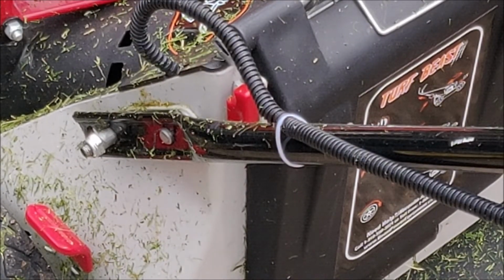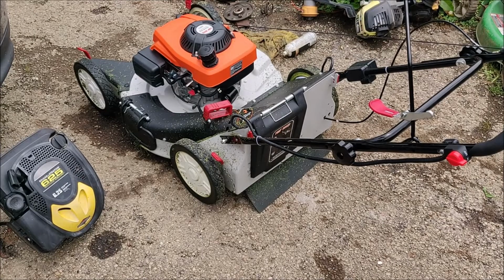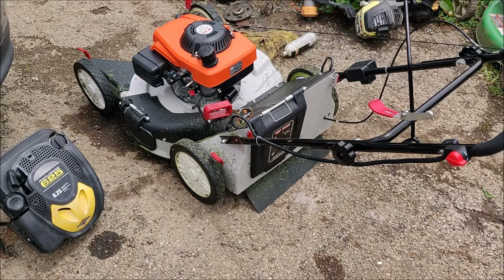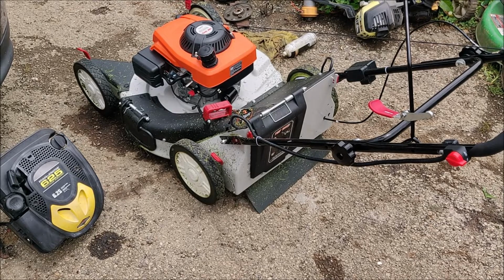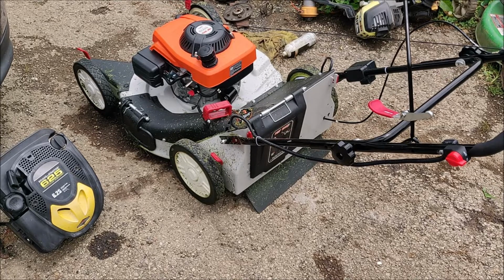The self-propelled is extremely fast. Normally I do like the faster gears, but with the big 10-inch wheels, I'm guessing they probably took somebody's generic worm gear drive ratio and then put it on here. But then when they put 10-inch wheels on here, things get sped up, so I'm guessing it's got to be almost 6 miles an hour just from what I'm used to. So a very fast speed.